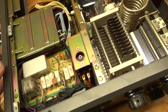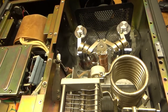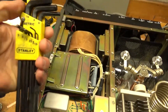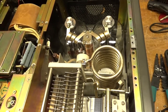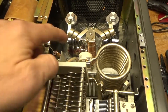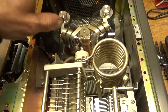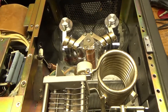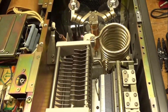These are nice amplifiers — I love these amps. The set screws are actually metric: M4, 0.7 pitch, requires a number two metric allen wrench. There are some other things you can do if you want — you can shorten the lead length, the inductance path between the plate blocker and the plate choke, and if you really want you can rewind the parasitic chokes. But it just boils down to how crazy you want to go. I'm going to put the covers back on and try it out.